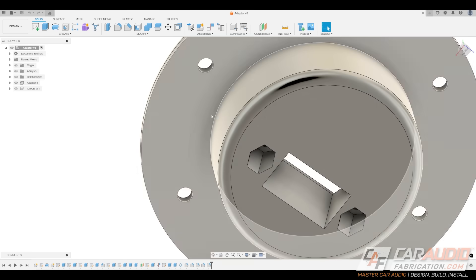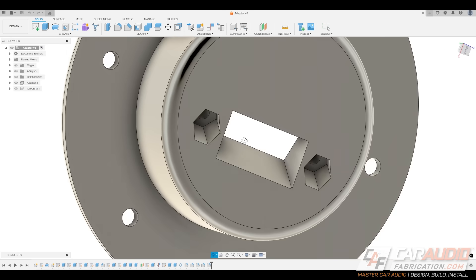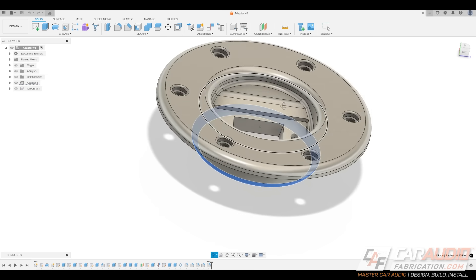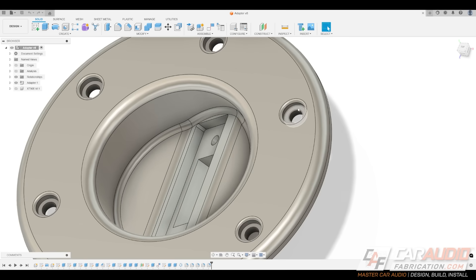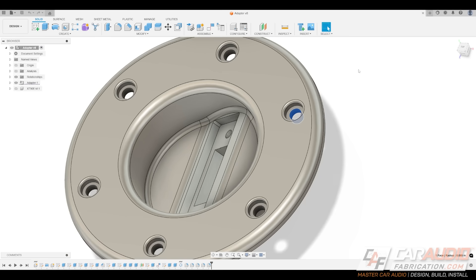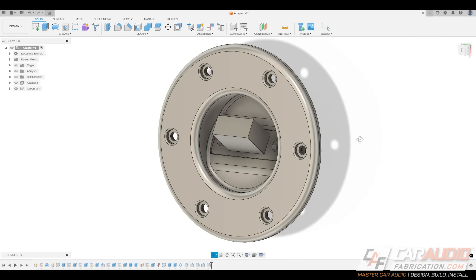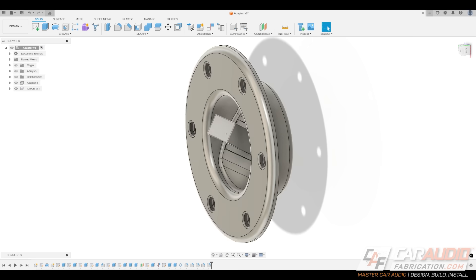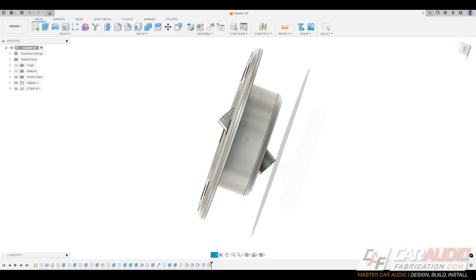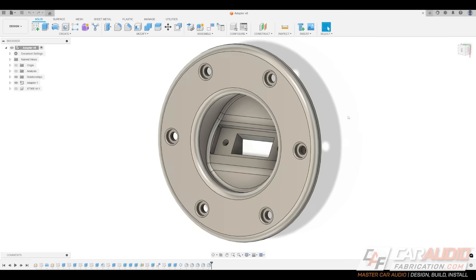On the back side, I've added hexagon-shaped holes that match the outside of the nut included as part of the hardware to mount the connector in place. I've added several different radii throughout the part to give it a nice finished look and add strength into the corners. There's a counterbore for each of the fasteners that will hold this to the enclosure — six of them — sized for a number six wood screw. Looking at the cross section, the part is designed to be quite thick for plenty of strength. I also modeled the XT90 connector itself, both male and female sides, to check all clearances. The plug has enough clearance to be reached by your fingers, and it's at an angle so the speaker wire can route along the side of the enclosure.